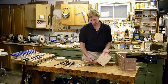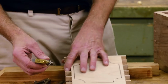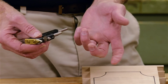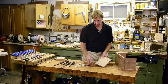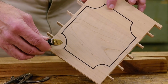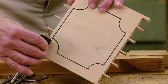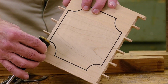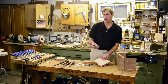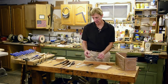And you can get different size cutters. I've actually sharpened them. It's really tricky, but they can be sharpened. And the cutters come in, I think, a 32nd and a 16th. It's essentially just a scratch tool where you get a center point and you just scratch your inlay. It's got cutters that are shaped like saw teeth. So it is very efficient, and you can make grooves very quickly with this. That's how I do pretty much all of my curved inlay.